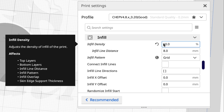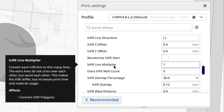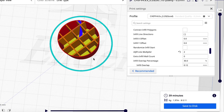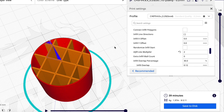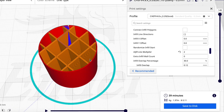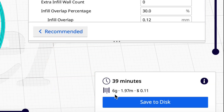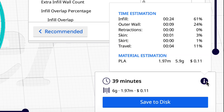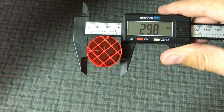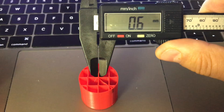Now let me show you a trick. Let's go back to 10% and go down to infill line multiplier. This converts each infill line to as many lines as I put in this box — I'm going to double it, set it to two, and slice it. Zooming in on the preview, you can see it's now two lines on the infill. Print time is definitely less, and it uses six grams of plastic versus the eight grams at 25% — so definitely less plastic. The diameter was good at 29.8.